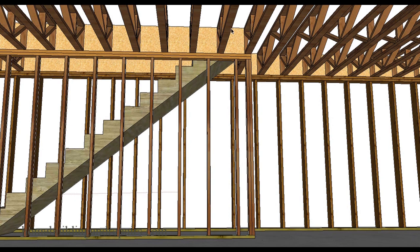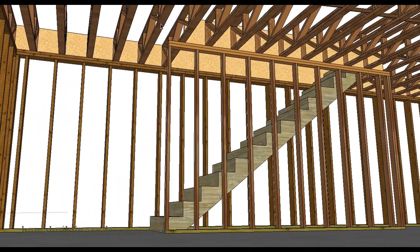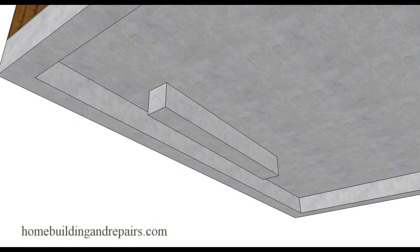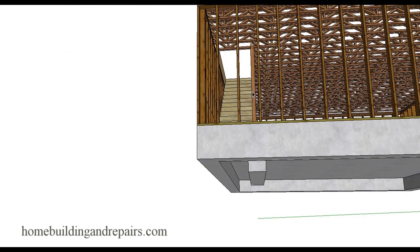This is something the product manufacturer would provide you with. Just like roof trusses, floor trusses are designed specifically for that particular project. You might even need a doubler underneath the truss to take some of the weight off. Here's a section view showing the footing that would be underneath the wall. Remember, load-bearing walls require a footing, so if you're building like this you're going to need something like that.